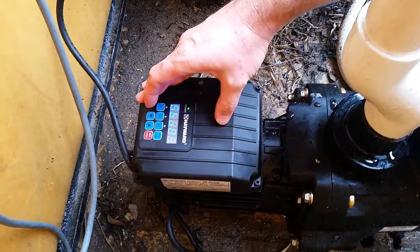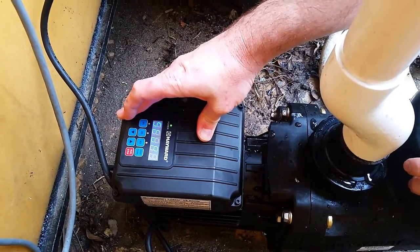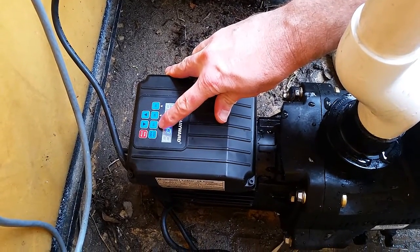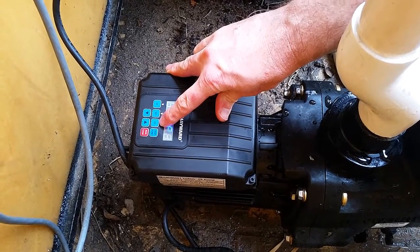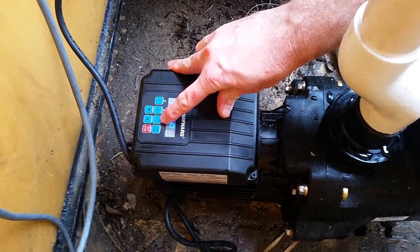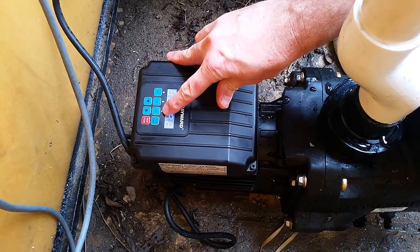You may find this one doesn't need to prime up for that long, so you can adjust that. It'll then drop down to speed 3 — it's set to five minutes but you can up that time. What we've done at Sampson's place is upped this to an hour and a half at 2000 rpm to run the TPC around the bottom of the pool.